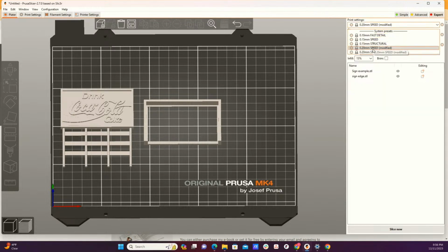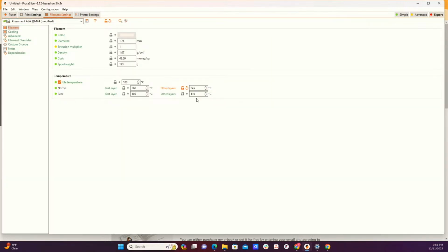And then you want to know how fast you need it to print. And once you have all those plugged in, you can just verify the plastic temps. A lot of times, different manufacturers will give you a temperature on the box that says the range they expect you should be able to print with it. And maybe you need to adjust it, maybe you don't. But you have control to verify these settings.